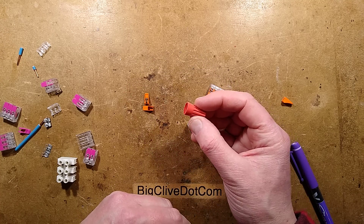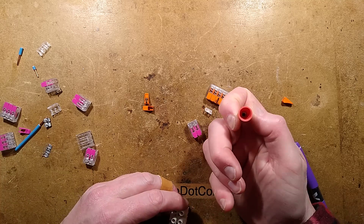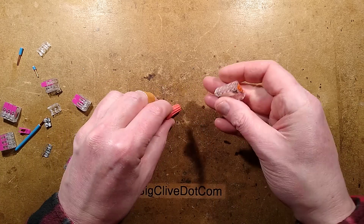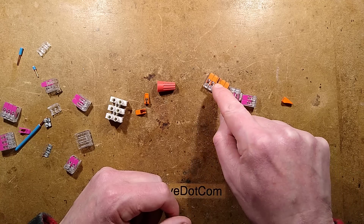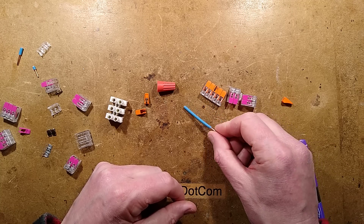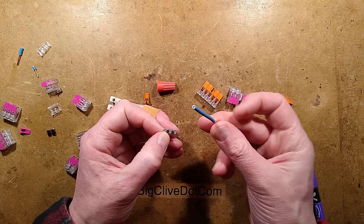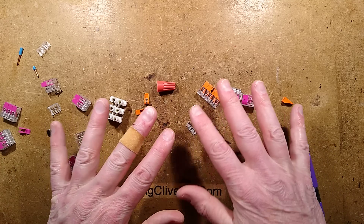There's the Marrette, wire nut, screw-it — lots of different terminology: Canada calls them Marettes, America calls them wire nuts, Britain used to call them screw-its, and they used to be ceramic. There are videos on the internet showing people wiring a continuous loop through a terminal block, then a wire nut, then a WAGO terminal, increasing the current to see which one gives first — and the one that gives first is the WAGO. But the current they go up to before it literally blows like a fuse — this 5mm wide, 0.5mm plate blows like a fuse at over 100 amps. If anything, the WAGO blowing open circuit could save your house from fire, though it's not any formal form of protection.